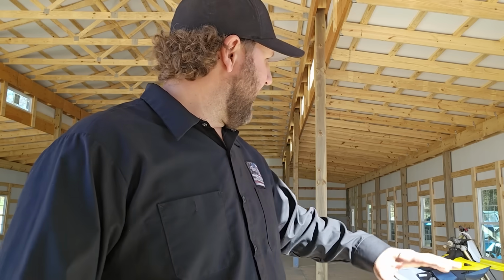What we're gonna be doing is, they're gonna be coming in and cutting these cracks, sawing them. They're gonna be filling them in, floating them, smoothing them out. This is all gonna get ground and sanded. We got machines, and then they're gonna primer it, and then we're actually gonna seal it with an epoxy, I don't know, ballistic paint thing. Okay, that's the plan. It is not going to last forever, but it's gonna fix what we got here and slow things down, and it's gonna look nicer.